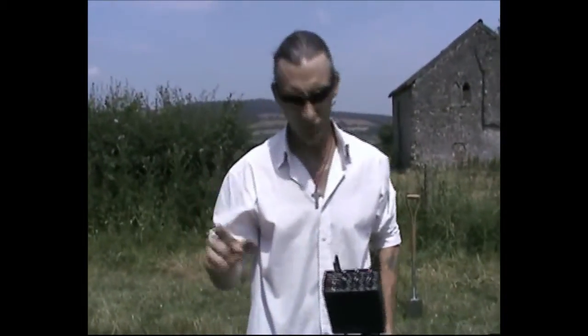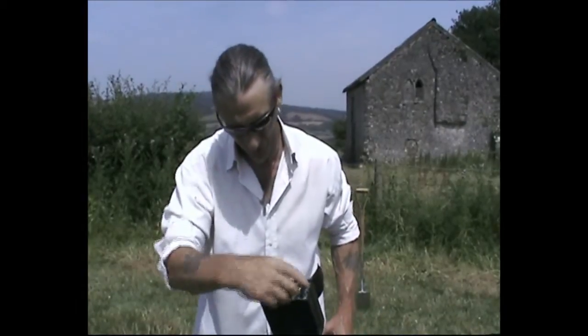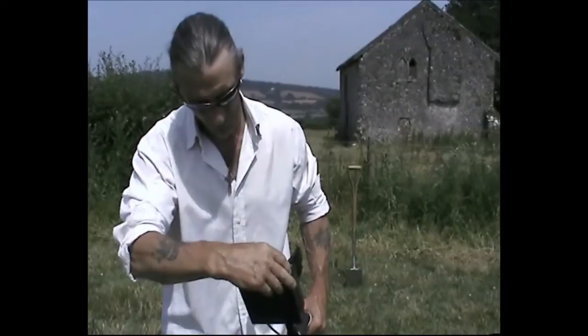Okay, before you turn your machine on, my advice to you is put your discrimination depth and discrimination level to 0. Have them ready there for your ground balancing and your neutral reading. Okay, so we can turn the machine on. Our headphones are plugged in. I can't use them now because you won't hear what I'm going through. So headphones are plugged in, machine on.